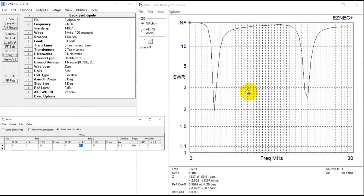Let's look over in the SWR box. You see here we have infinite, and it comes down to a 2 to 1 SWR at the 7 megahertz point — this is where the system is tuned, it's a 40 meter antenna. At 15 meters, it comes back down again to about 2.5 to 1. This you can tune with the wide range tuner, or even the built-in tuner in your radio that handles anything under 3 to 1, and you'll have excellent results on 40 meters and 15 meters.